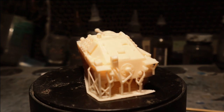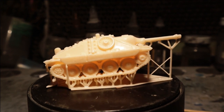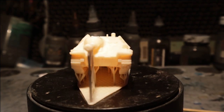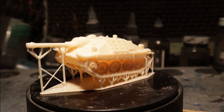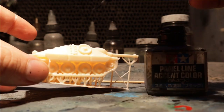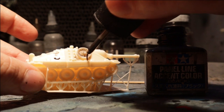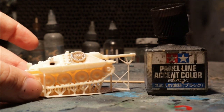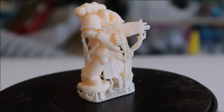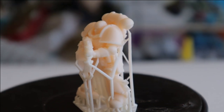With multiple prints of this same tank, the standard and high definition of the Spark Maker and Mono X still had some ridges solvable through filler primer or sanding. This piece is immediately ready for painting and smooth via the raw resin itself. As a demonstration, putting some panel line wash against the grain of the Z-axis and nothing seeps in — completely smooth. No overhang, warpage, or distortion of the tracks and wheels. Incredibly impressive improvement in technology. The space marine facial and mechanical detail is very defined and crisp, suitable for hand painting.